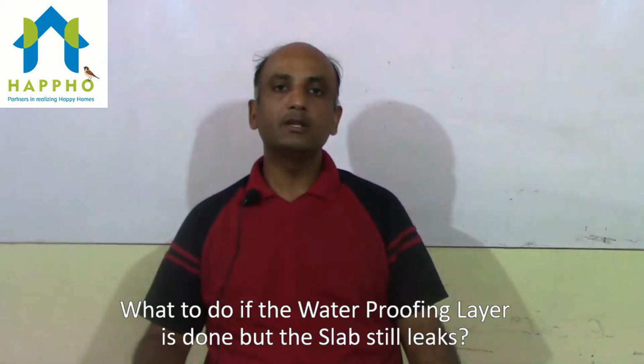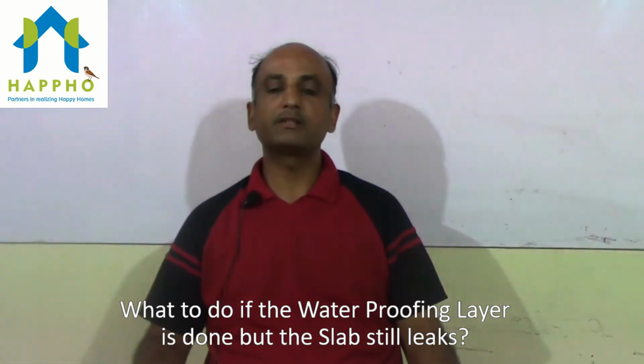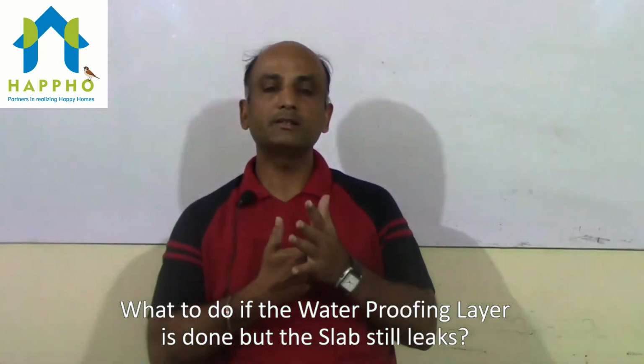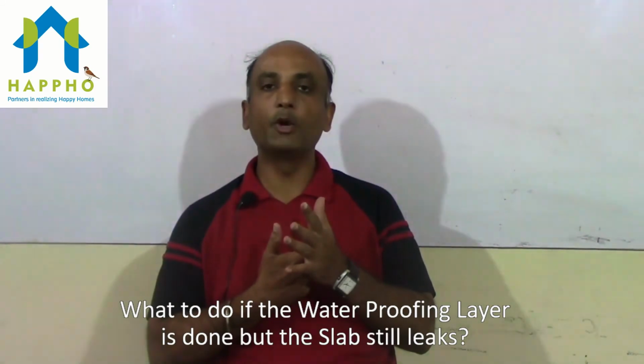If you are able to see localized dampness, then you need to identify two signs of distress. The first one is to look for cracks on the slab. The second one is to look for debonding of the top screed. In order to identify the debonded screed, you need to knock with your fingers. If the sound is hollow, then you can infer that the layer has debonded.